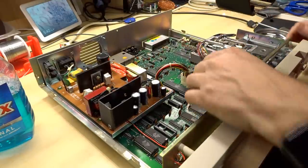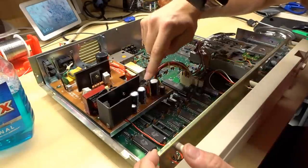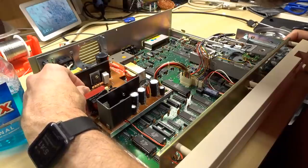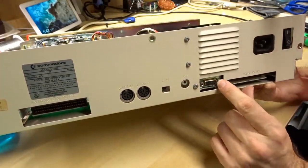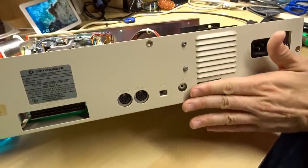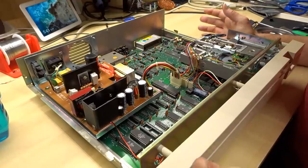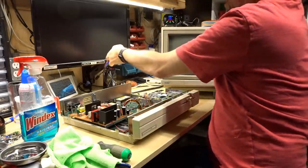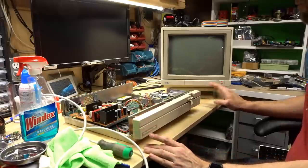Let me give this a once-over before I attempt to power it up. This cap has shifted out of position a little bit. Marcos probably wasn't able to test it before sending, so we'll find out together if it works. The electrolytics all look fine, no damage. It's using polymer filter caps as opposed to RIFA, so no RIFA caps to worry about. The power section looks pretty good. The RGB video connector is at a weird angle and doesn't quite protrude from the back of the case, but the case doesn't show any impacts there. It's time to test this out — let's plug it into a monitor and power it up, with the lid off in case any smoke comes out.